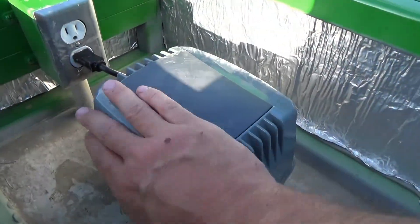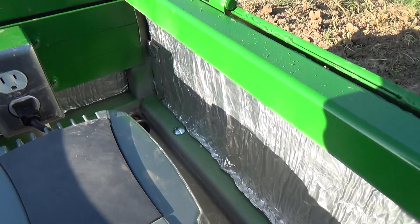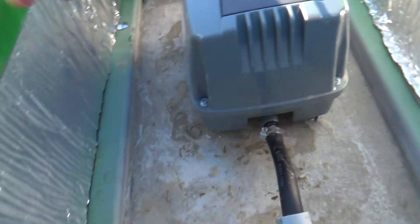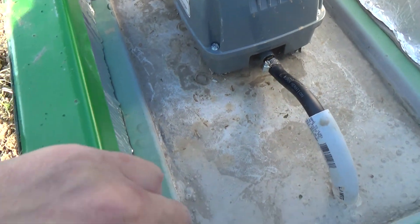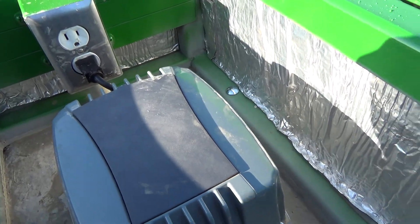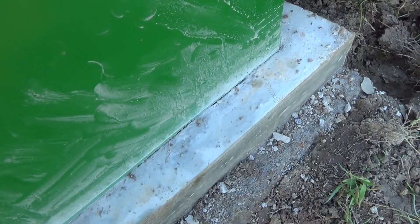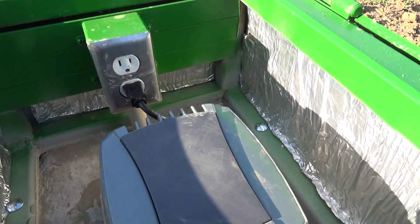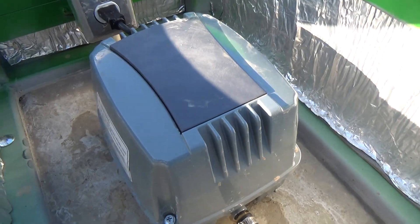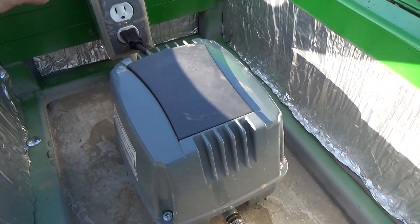I am a little concerned that the unit is pretty warm, so I'm going to leave the lid open and see if that has any effect. I put four carriage bolts — two on each end — to anchor it down into the concrete slab, so if a cow gets to rubbing or pushing on the box it'll keep it from coming out. Eight bags of 80-pound concrete is 640 pounds of concrete in the ground, plus the pressure of the ground around it — I think it'll definitely stand any animal pushing on it.